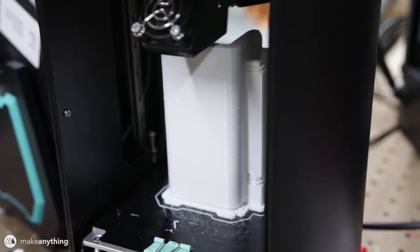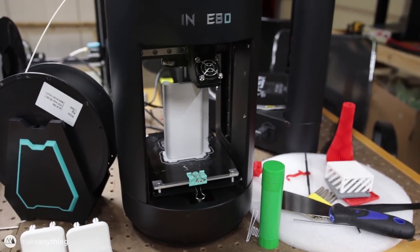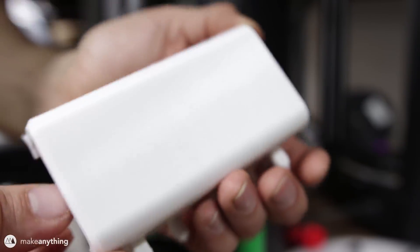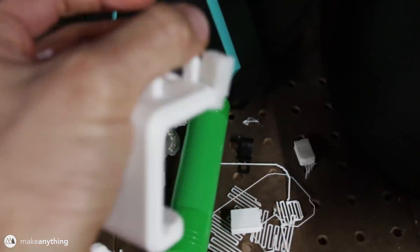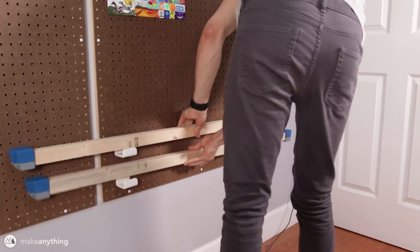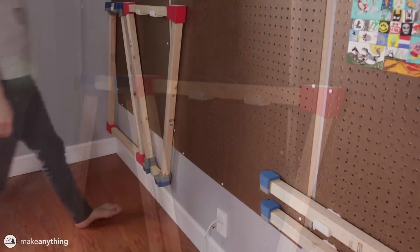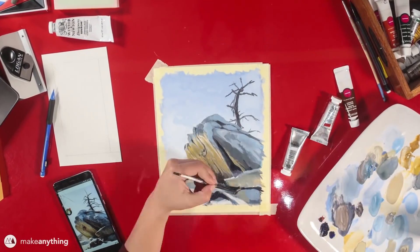I ended up reprinting those parts on a little Zincbot Capsule 3D printer, which costs about a tenth of the price of the M300. While the layer quality isn't quite as perfect, it still looks really nice, and I was actually able to get the support material off super easily because I made those supports in Simplify3D. Once all the parts were printed I positioned them on the pegboard and snapped them into place — it's a really nice and easy way to throw the parts up on the wall. I did the same with the legs on the side and it worked great. Here's another cool time-lapse of one of Natalie's paintings to show what this thing can really do.